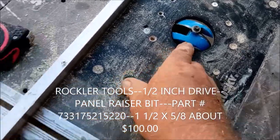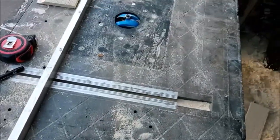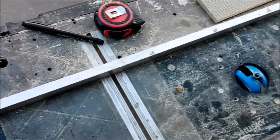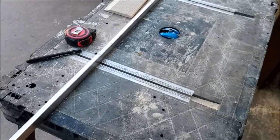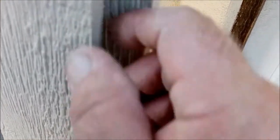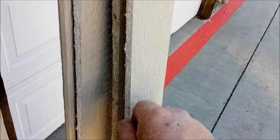I'll post the information for this particular router for you guys. You want to set the depth gauge so you get the curved element. Set your router table up and set yourself up a good long fence - that'll make your life a lot easier. It should look something like that. When you go to route this stuff, you want to route the cut edge, because you have a beveled edge on the other side. If you make a mistake and route that edge, it's no big deal - you can sand it and paint it and you're fine - but if possible, route the cut edge.